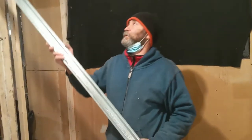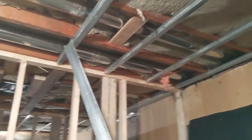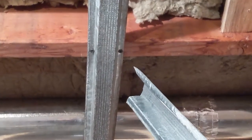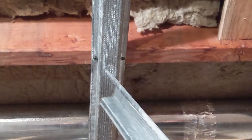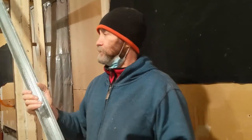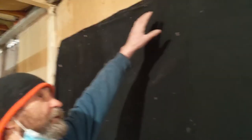How it works is you see here — we're gonna have a space that the sound can travel, and we just have few screws to hold it together. The point of contact for the drywall would be just on those points, two screws holding up. And that is how we eliminate some of the sound. This is very easy — you just screw it on.